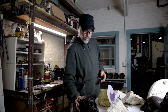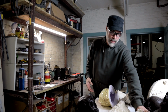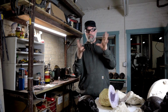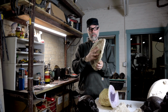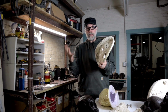As a final maintenance thing for the day, even though we might be coming back tomorrow, we don't want the mold just sitting around open. Because of the plaster and the way we saturated it with water, if we let it lay around for a day or two, it could potentially distort. The plaster is really not that thick. It's about 1/2 inch thick up here along the seam, but out on the surface it's only about 1/8 inch, less than 1/4 of an inch.